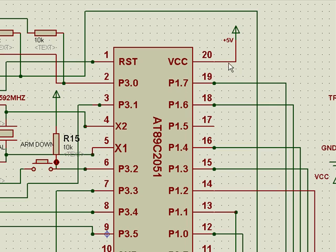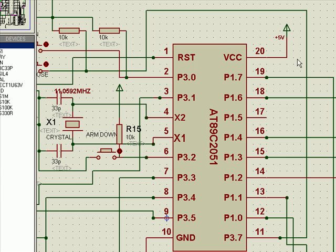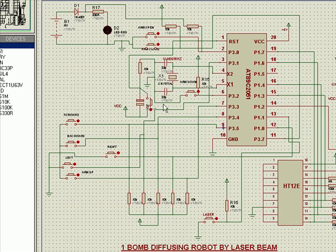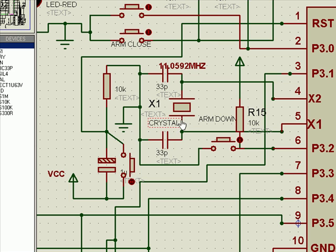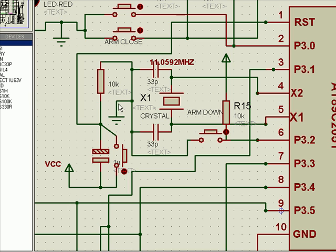Though the microcontroller requires 5 volts, giving a voltage of 5.4 volts doesn't much affect the microcontroller, so here we get roughly 5.4 volts, though we have mentioned 5 volts. And the other things are very standard and we have discussed them. For any microcontroller we require a crystal, and then there are capacitors and the reset pin. The reset pin is connected to a capacitor and a resistor. They are all separately explained, including the purpose of each and how they are connected.